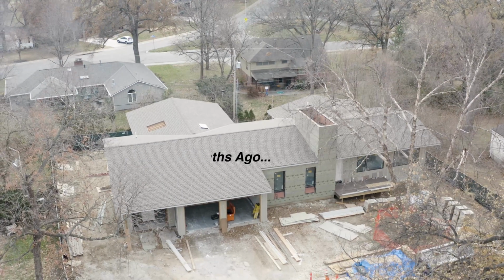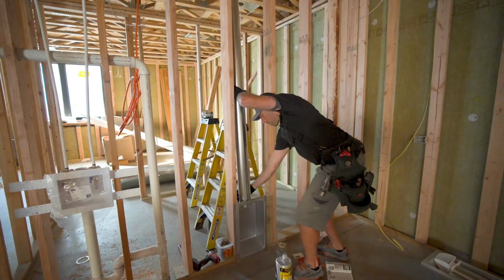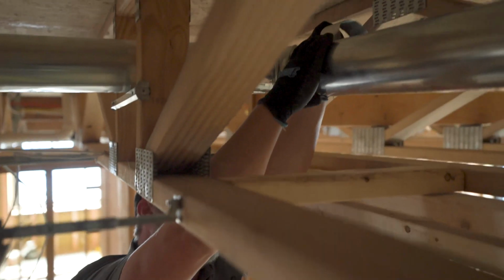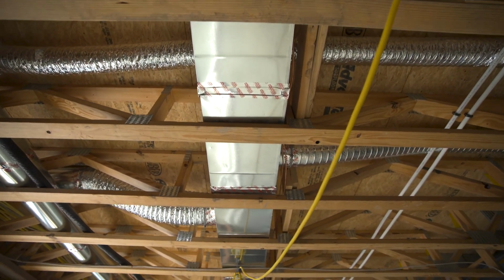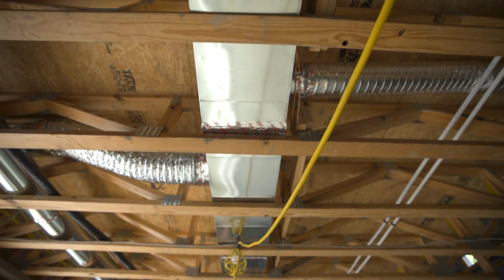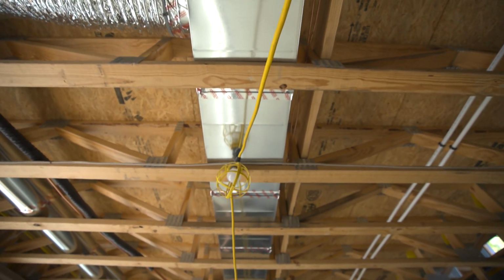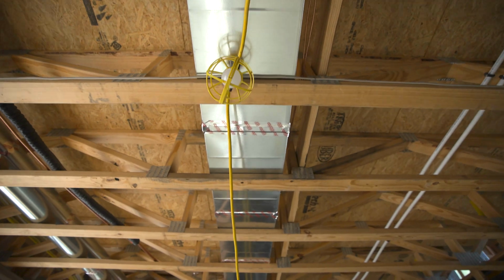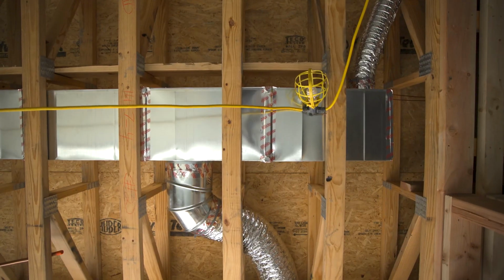All right, Joe and I are back here in the basement. Now, ordinarily, we wouldn't allow any flex duct on our projects, certainly not for a dryer. That's why you saw us hard piping the Innovate systems, but not even really for ductwork because you lose so much through friction loss. You're reducing the amount of air that's traveling through the duct at the velocity that you want when you have more bends, and obviously flex duct, it's a rough surface, it's a lot of bends. So with that turbulence comes a cost.